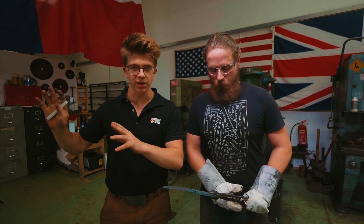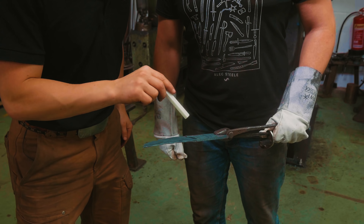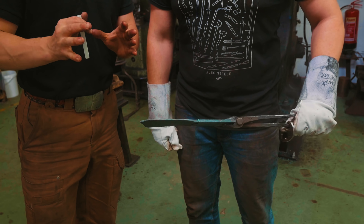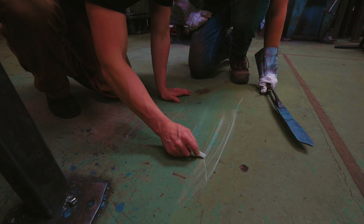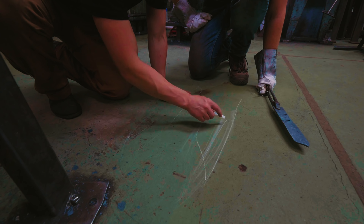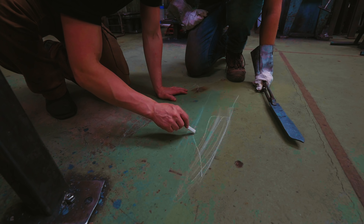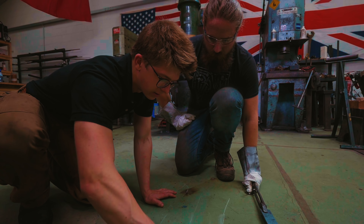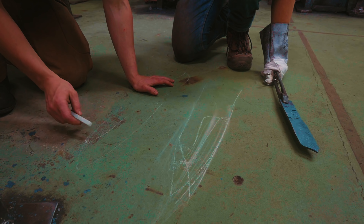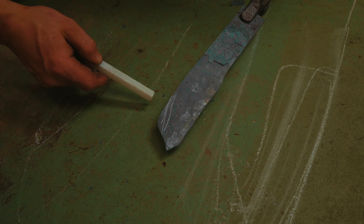Alec has been doing this unsupervised — I've just been working on the pommel for the Falchion. I want to know what the plan is from here. You've got this point coming down like this and you've already got some rather thin bevels. What was it meant to look like when it's finished? A spear point-like tip with a bevel coming along that edge. For this shape of blade, you want a much more acute angle before you even start hammering your bevels, so that as you start hammering the bevels, they can extend and that tip has room to go up without a big obstruction of metal. That's going to help you get that shape better as this material moves out that way. Otherwise, see what's happened here — you forged the bevels, but there's still way too much material up here. That needed to be thinned down and tapered before you do anything else.